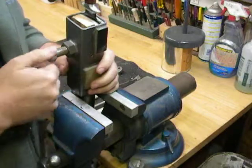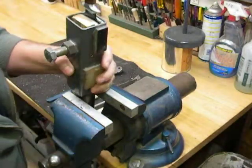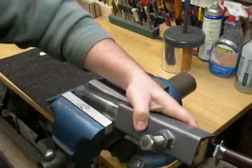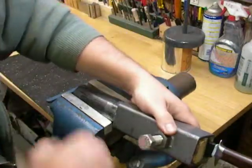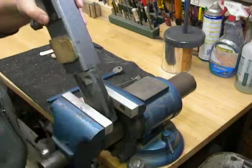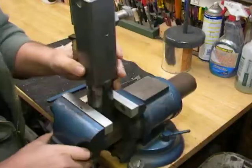We've been talking about using an adjustable ratcheting locking lever, which would be nice, but anyway, tighten it down, get it secure, and now instead of being limited on how we can position this thing to work on the handle, we have an infinite number of positions we can put this thing in. Because of it having this pipe on it, you can rotate this in any position you want. If you have a swivel base on the vise, then you have even more options.